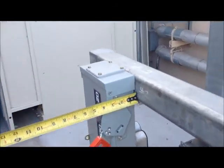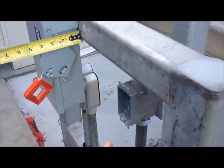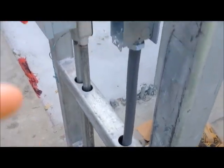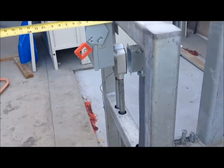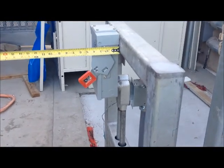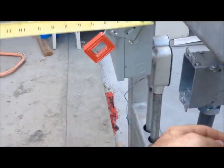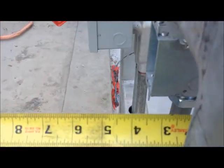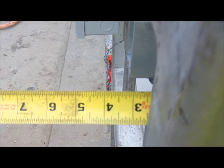So the next requirement was to provide a fusible disconnect that can still fit in here — and this area actually gets encased with a stainless steel surface. We suggested keeping it here and just adding a wing guard, but that keeps getting rejected. So we need a solution. You can see the depth here — Lee, what is the depth of this thing? It's about two and a half to three inches.